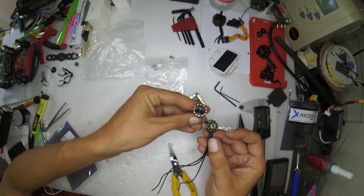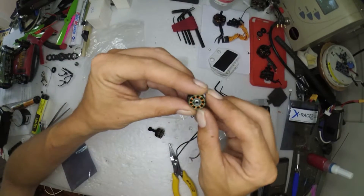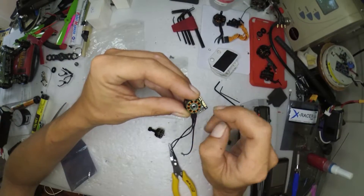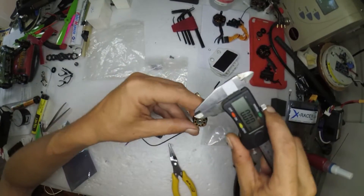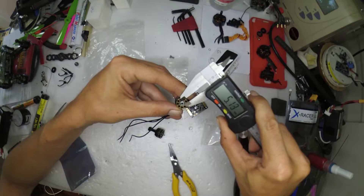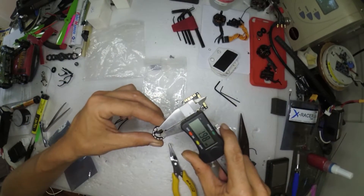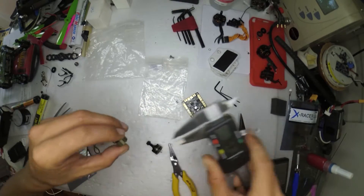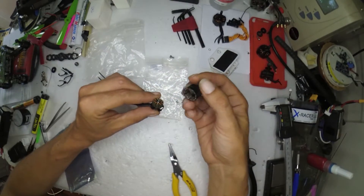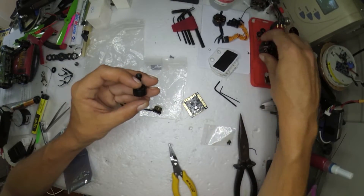Yes, they have been balanced — there's the blue gook. Look at the size of these bearings, they're like thick and tiny. I don't know, they're about five millimeter by two, so we've got a two millimeter shaft — so a 5x2 by about 3mm bearing in there. It's a pretty small bearing, pretty small motor really.